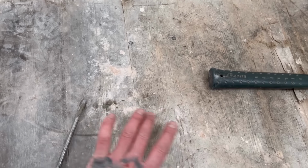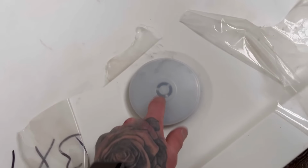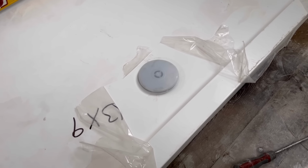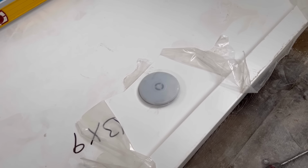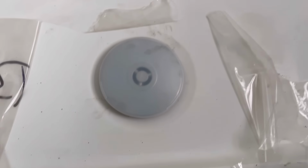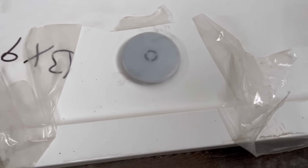Just going to find the joist here, so I can cut a hole out and pour some water down this trap and just check it's running perfectly sound and there's no leaks. Well, that weren't a bad little guess, to be able to reach my hand under there and feel that trap. Just pour a bucket of water down it, just test all this. The floor's being tiled, and once it's plywooded and tiled, that's it, it's game over. Obviously the ceiling downstairs has already been plastered. Yeah, best check this now.